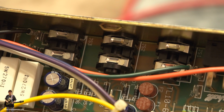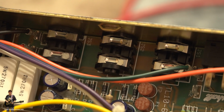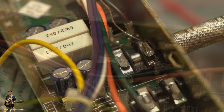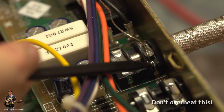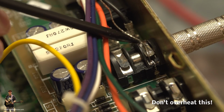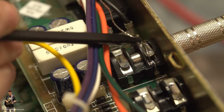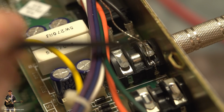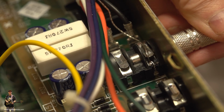There's a quick shot of all 3 of the output jacks. Okay, so there's JS3. I've taken a wire and soldered it to here, ran the wire over the top, and soldered it to the back of the arm. So the arm actually is free of the wire except at the back. So this bit can open up and down. When I pull the jack in and out, you'll see what I mean.